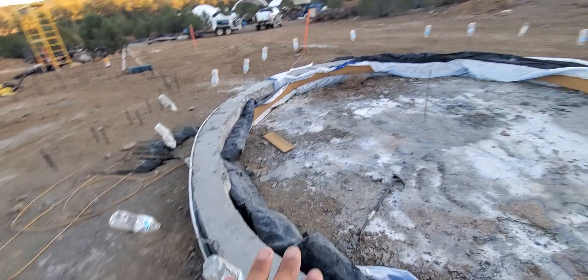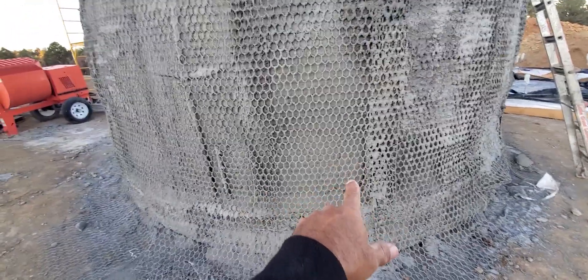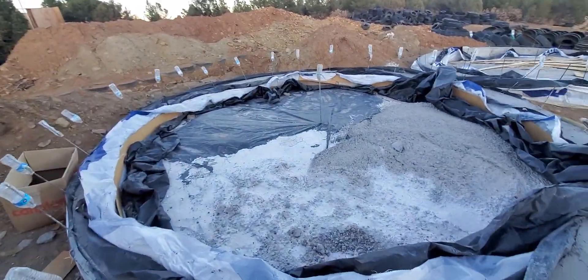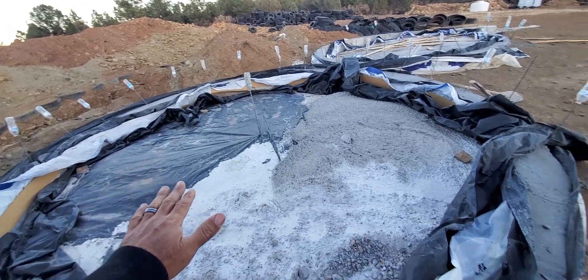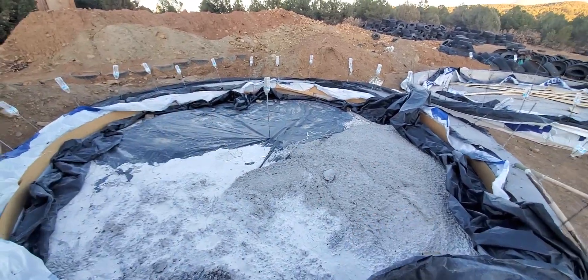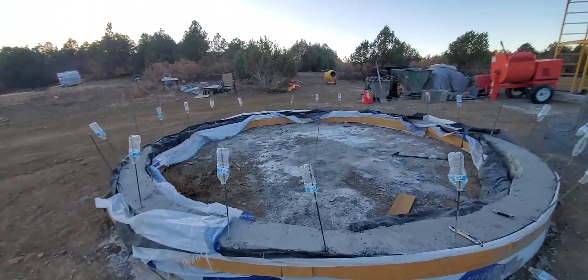This is the ring beam setup. What's next for this ring beam is an aircrete slab for insulation. We ended up mixing 1,200 gallons of aircrete for this dome. We have a vapor barrier down, and then aircrete will go on top of that to insulate the whole slab, and then on top of that will go one to two inches of regular concrete as a hard-coat wear surface.